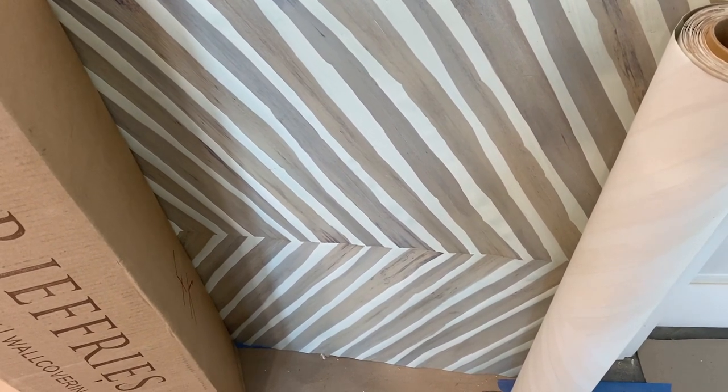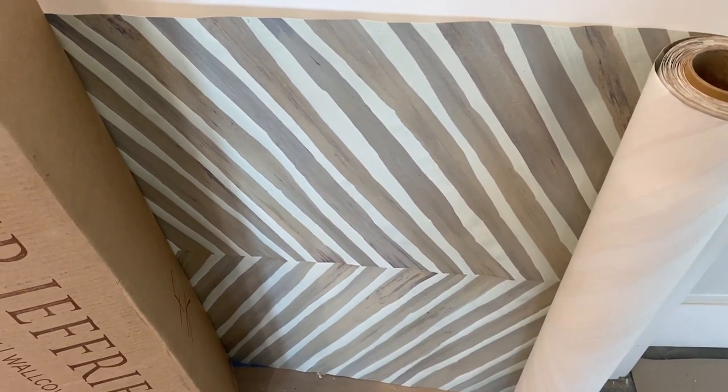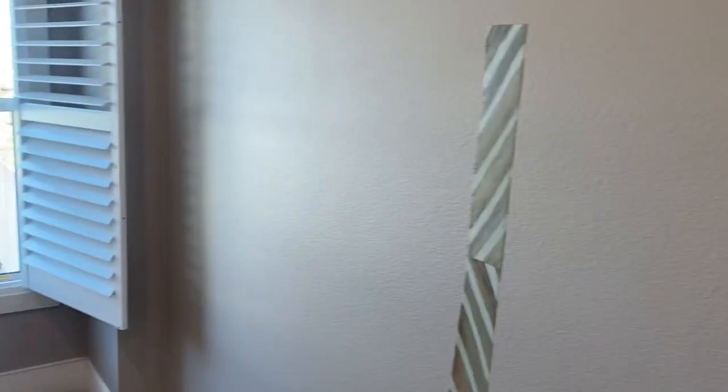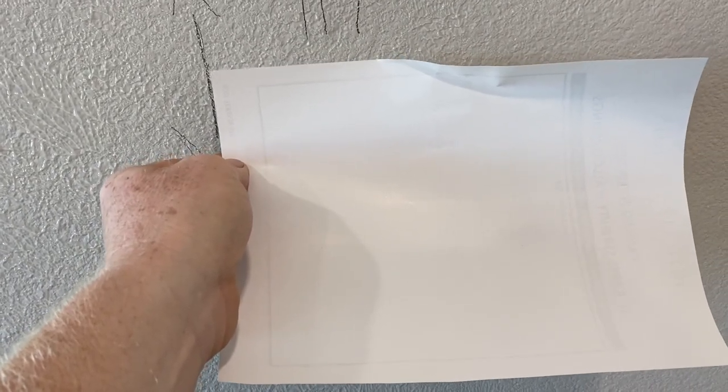First, this is a glue-the-product wall covering. Our wall is 234 inches wide. Half of 234 brings us to 117 - that line represents the middle between the left and the right. The only other consideration is: do I start my wallpaper in the middle of the wall covering, or is it better to start each sheet from the middle on either side of my central point?